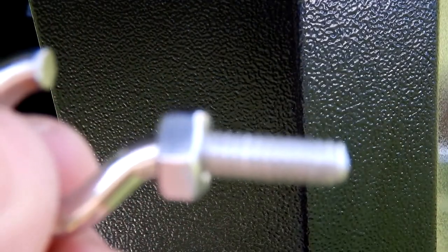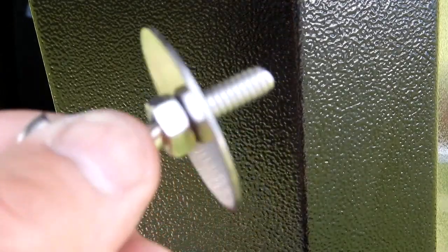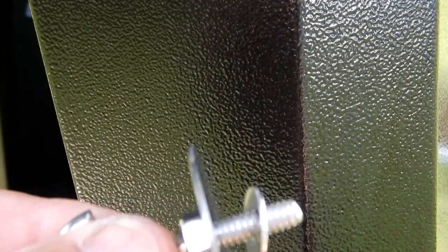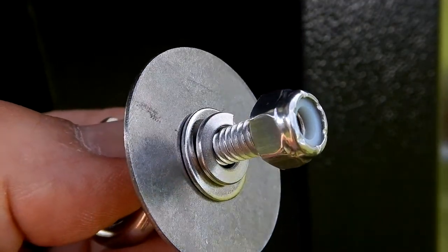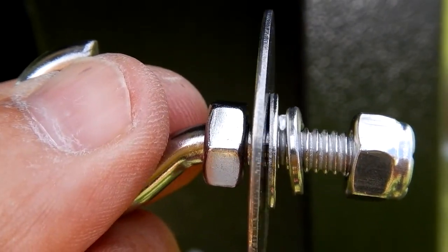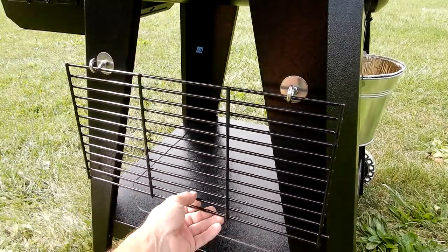To attach the hooks: take the hook and an oversized quarter-inch stainless steel washer — inch and a half in diameter — and slide it on. This goes through the outside hole. On the back side, put a regular quarter-inch washer, then a lock washer, then a nylock nut. The reason for the lock washer is just in case heat gets down this low and melts the plastic on the nylock — it's added insurance. There are the hooks we made out of those eye bolts.